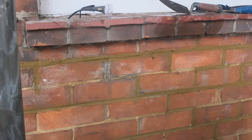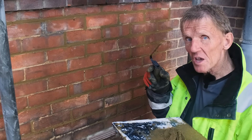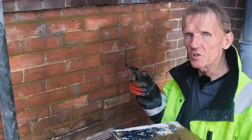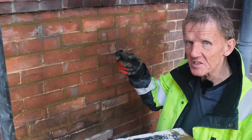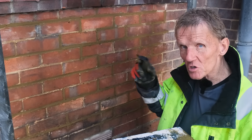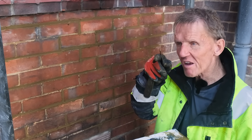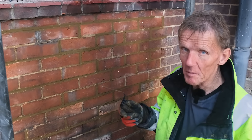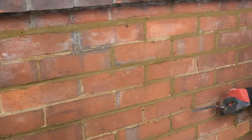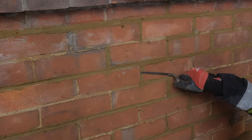There may be people looking at this who think the grouting was a little bit shallow in places, but the important thing is if you go straight on with the pointing while the grouting hasn't cured, it's wet-on-wet and it will all knit together. If you leave the grouting to dry for 24 hours, then you need to make sure you've got sufficient depth to get a reasonable amount of pointing in there — generally 10 millimeters minimum. And that's it, that's the job done.